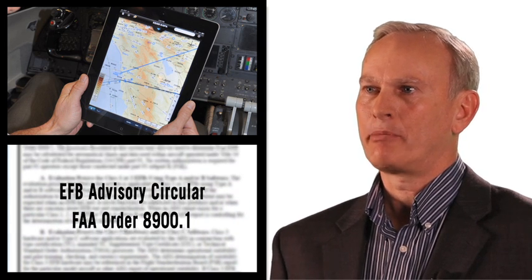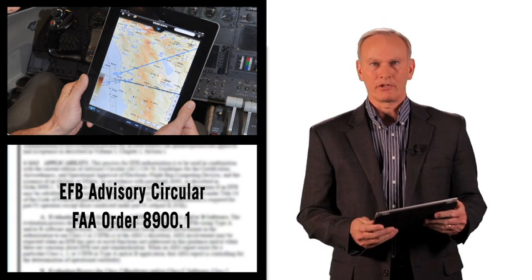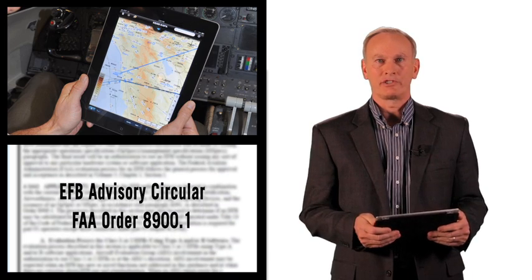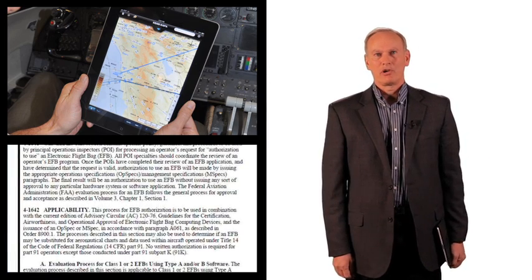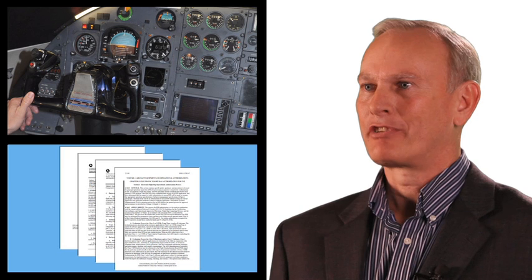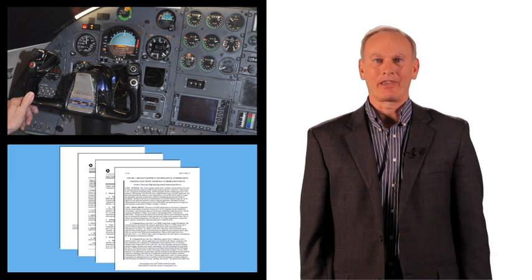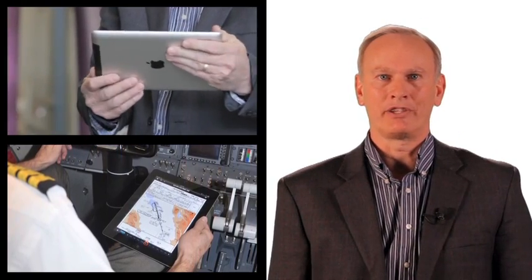First has to do with lithium ion or lithium polymer batteries. For devices like iPad, whose battery is internal, it must adhere to UL or UN standards. For devices whose batteries are removable or external, additional care and handling procedures apply. Certain tests ensure that the emissions from the computer will not interfere with airplanes' avionics, including radio, navigation systems, and autopilot. These tests are done in a lab, on the airplane, or a combination of the two. Because non-interference testing is unique to airplane and avionics combinations, it's normally done on the airplane, both on the ground and in the air, following an industry standard checklist.